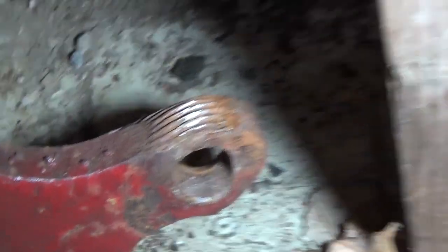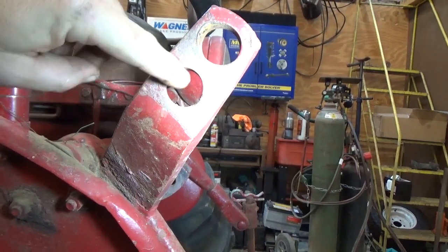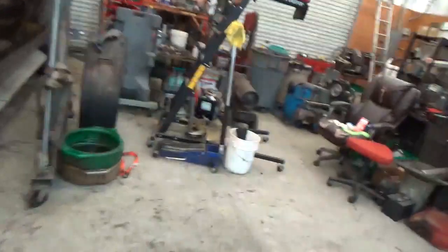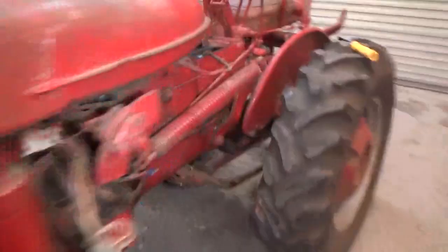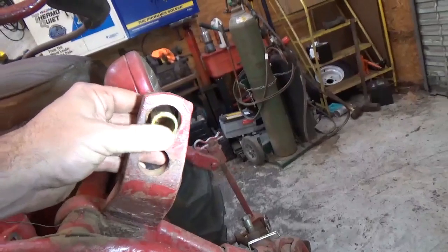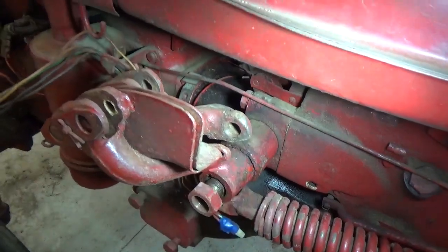Definitely subscribe and keep up with this job because you're going to like how we fix these up. We'll actually resize these, re-round them, and do any bolstering we need to do. We machine some brass inserts — brass bushings — and put them in there. Here's an example: definitely not the right size but you get the idea. We'll cut these brass bushings, machine them to fit, then drill a hole through so we can add a grease fitting that can be maintained. We'll do the same thing up front, and these bushings will be easily replaceable in the future. It's a great upgrade.